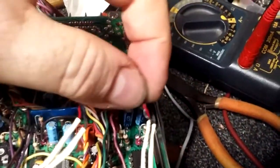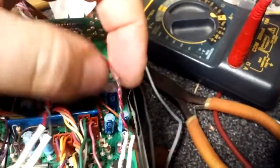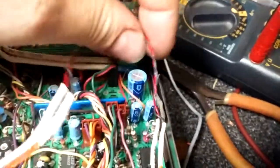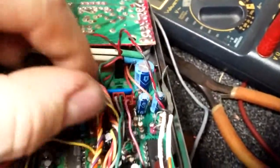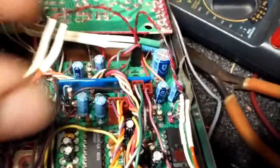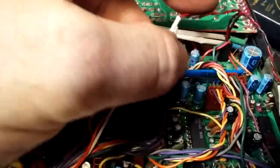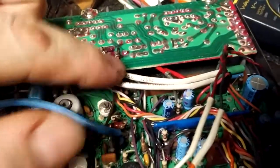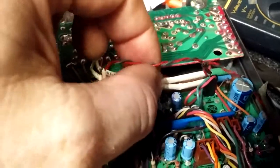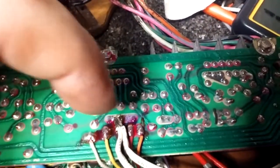Here's our left and right signal cable. I've got red as the right, and this kind of a brown-gray color as my left. This one goes out to my input jack, and it happens to be color-coded blue down there. These are the feeds back — right and left. These wires here are just the shields on my shielded cable. I've got them in heat shrink so they don't short anything out.